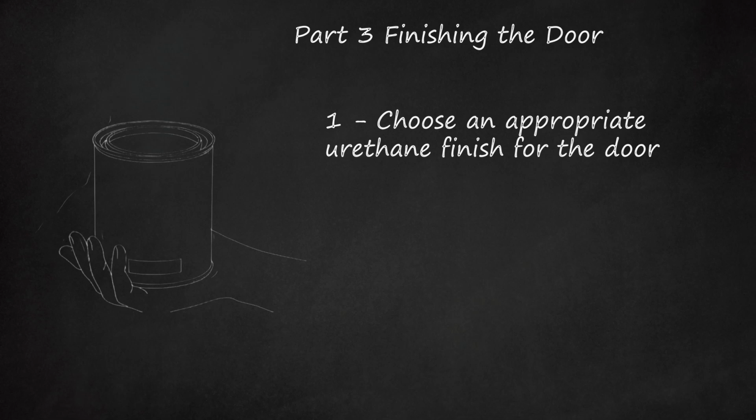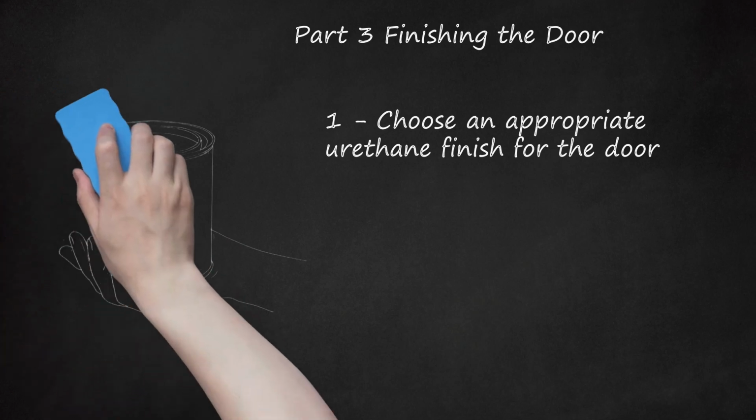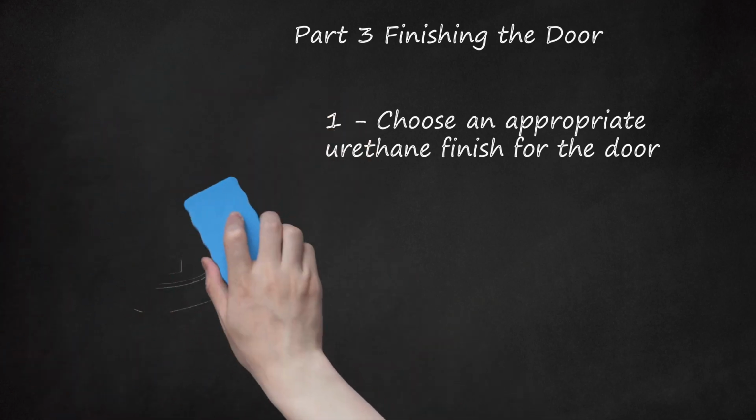Water-based finishes are somewhat more environmentally friendly, but can also result in that peach fuzz texture that the stain creates as well. Apply the finish using a similar application and buffing process, using the steel wool or sandpaper between coats. Wipe down the surface with a wet rag. Allow the wood to dry thoroughly before applying finish, sanding it lightly if necessary before you begin.